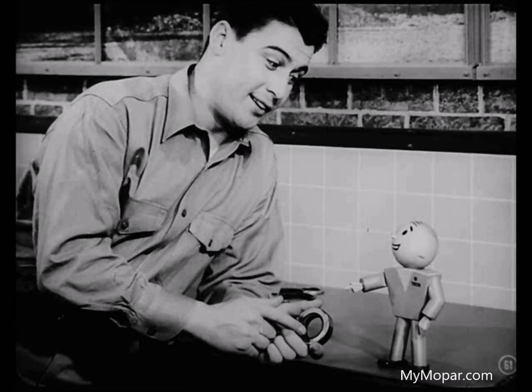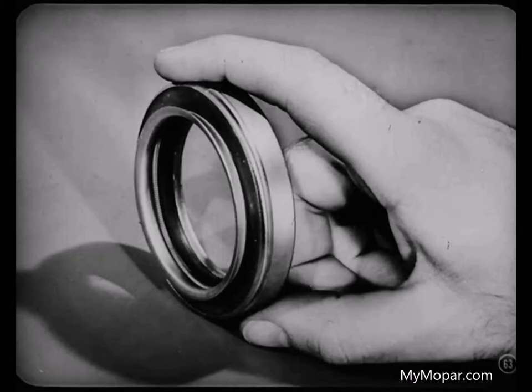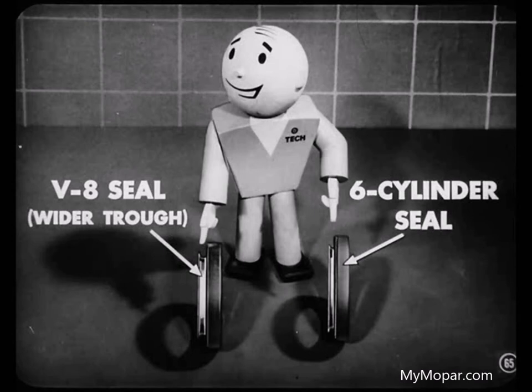When that transmission main shaft rear bearing seal is installed, it should project slightly from the face of the housing. If the seal is driven too far into the bore, the seal lip will not run on the ground part of the shaft, which could cause a leak. Use the approved driver to position the transmission seal correctly. During installation, place the seal squarely in the bore with the seal lip toward the lubricant — that lip acts as a scraper to keep lube from working out. Be careful not to install the seal backwards by mistake.